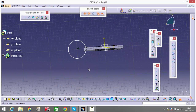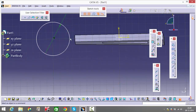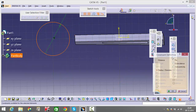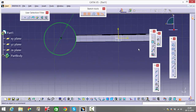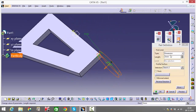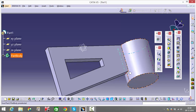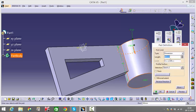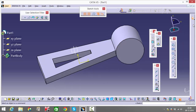They've mentioned the diameter of this to be 50. I can make this end and that point coincident so it just closes the surface. I'll exit my workbench — I think the pad length is 60, reverse direction. Actually checking, it's 50. There's a pocket here too, so finish making that pocket.